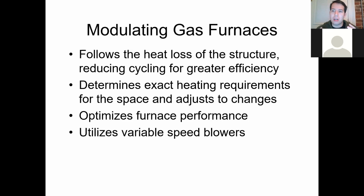But the big adjustment is it's almost like that. They might not be 100 speed, but they're probably gonna be like 50 speeds. And that's insane. It used to be a big deal when an inducer draft motor and a blower motor both had two speeds on a two-stage furnace. Nowadays, we have modulating controls that use DC electricity and can control and allow for just incremental amounts of speed and power to pick up over time for that system.